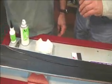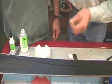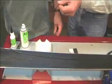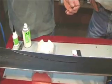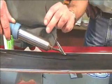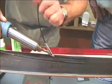So if people are having difficulty with the rod melting in the welding unit itself, it's because they're not moving the material through the speed tip quick enough. Correct. Either the tip's too hot or they're not moving it quick enough. Okay. Push it out forward a couple of inches, start moving quick, and then slow down to get the right speed.